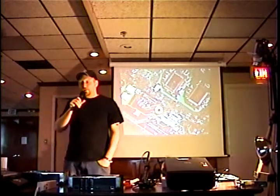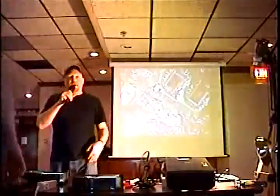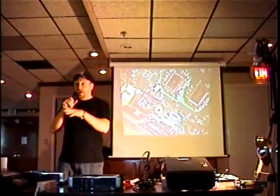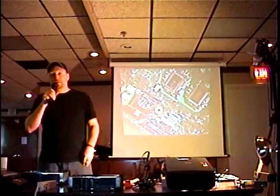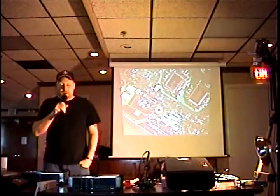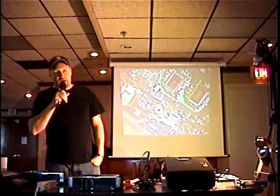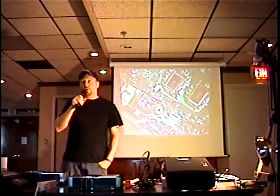So now we've got a backup of our Xbox. We have everything that's on C and everything we want to keep off of E. And we've got that on our computer stored safely if we need to go back to it again. At this point, you can power down the Xbox, take out the retail drive, get your large hard drive.